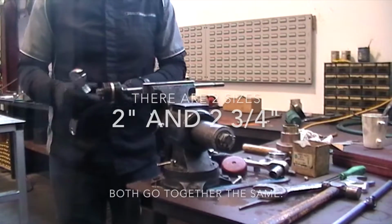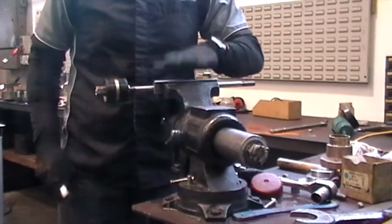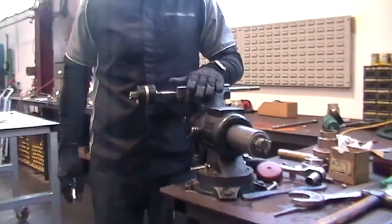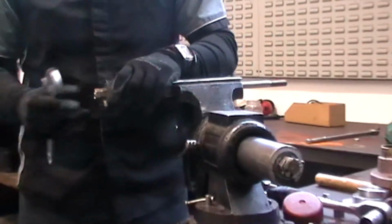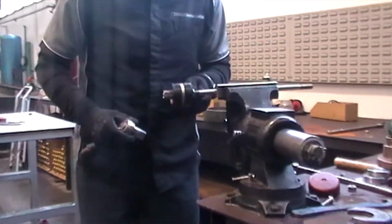Okay, now let's take the plunger assembly apart. So first thing we've got to do, just check the plunger rod. Also, when I'm taking this apart, I want to hold the plunger rod itself firmly. I like to use a set of soft jaws. If you don't have soft jaws, a couple of pieces of wood work quite well, but I don't want to scar this plunger rod. So first thing I'm going to do is loosen off these nuts.